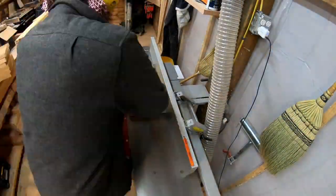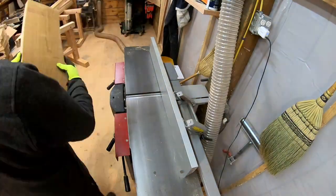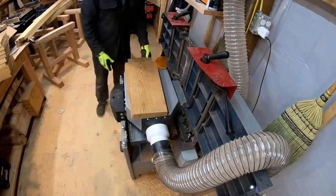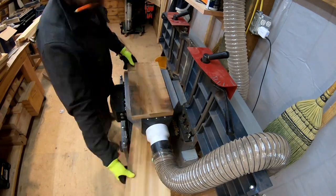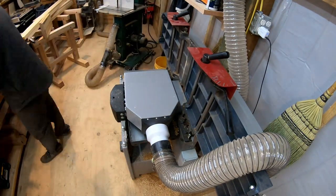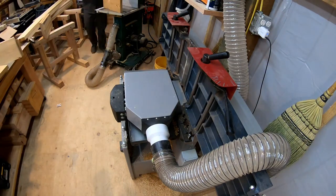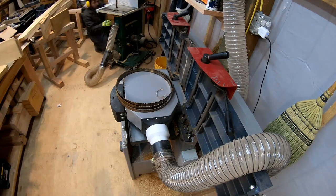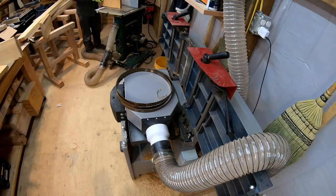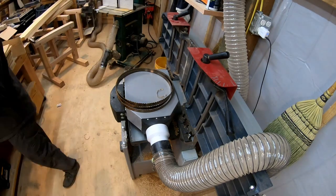So you finished all the frame components, and now we're working on the hip board milling. That's the board that's at the bottom of the shoji door, which in most cases keeps your cats from going through the shoji paper. So I dug through a lumber pile at the local lumber supplier and managed to find two pretty clear Western red cedar trim boards that were much too nice for the grade of wood that was being sold there, but I snagged them anyway.